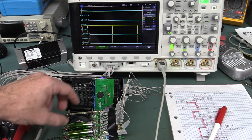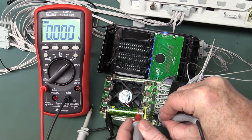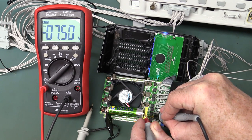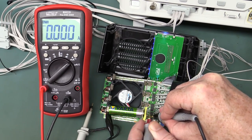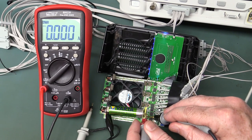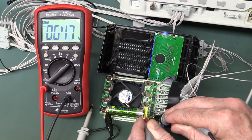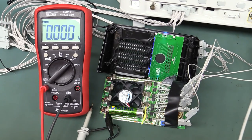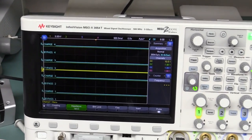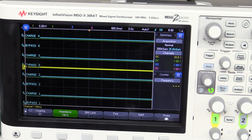With a discharged battery I can just briefly see the meter reading — there we go, 7.5 amps — and it just switches off. We only have about a second before it gets to its next detection window. So it does actually charge at around 7.5 to 8 amps. If I discharge just one battery, all the bypass FETs are turned on and all the charge FETs are turned off.